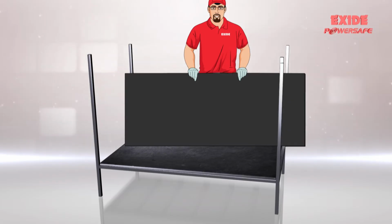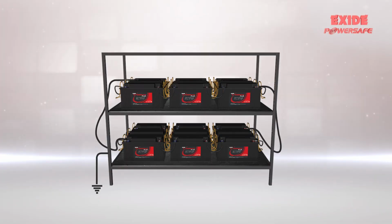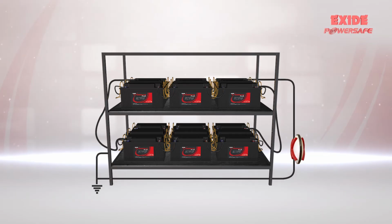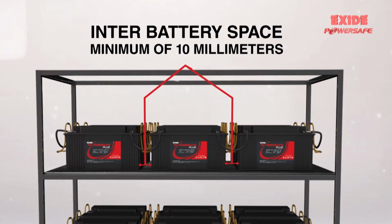Batteries should be installed with an insulating PVC mat at the bottom to prevent any leakage current to battery rack or ground. Ensure isolation between positive terminal to ground or negative terminal to ground. Inter-battery space should be a minimum of 10 mm.